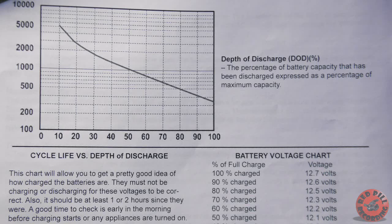And the batteries are going to be expensive. You're not going to want to use batteries that you get at Sam's Club. And the batteries can last 10 years. How do you make them last 10 years? I have batteries that I've had for more than 10 years. And the way you make them last way more than a couple of years is you only discharge them 20%. So you leave 80% in the battery. So what does that mean? It means that you need 80% more battery power than you think you do.